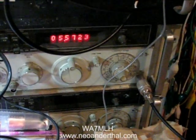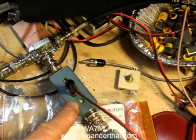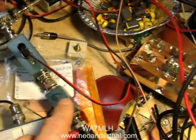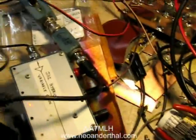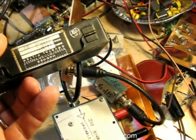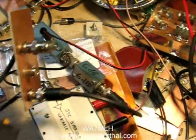There's a frequency of 5572 kilohertz on the LO. Then coming out of the mixer into a broadband post amp — probably about 16 to 20 dB of gain roughly — a 6 dB pad, and then into a crystal filter that I got from W7ZOI. This is a really cool little unit made by Hughes Aircraft — a 1750 kilohertz crystal filter with some pretty steep skirts on it.